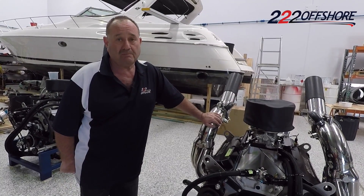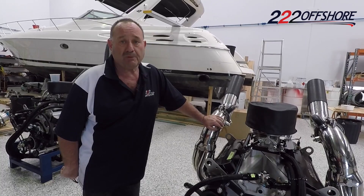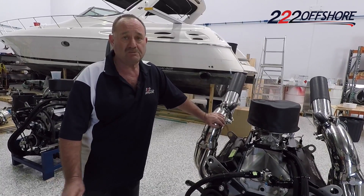So particular care with the water pumps — we make sure we haven't got a broken impeller or something like that, otherwise we aren't going racing.